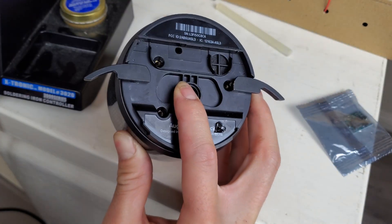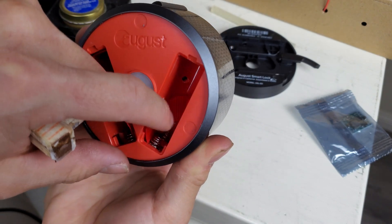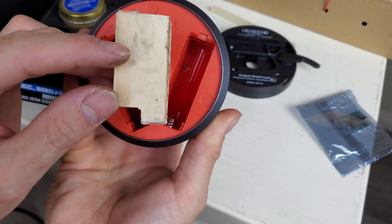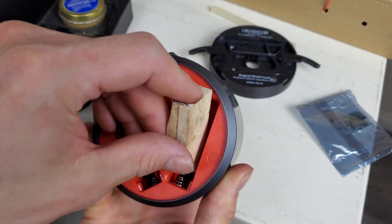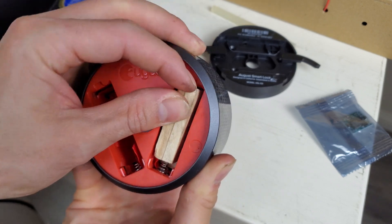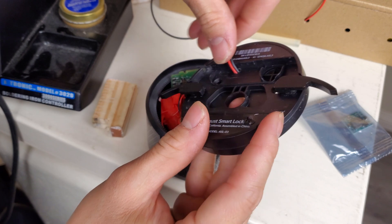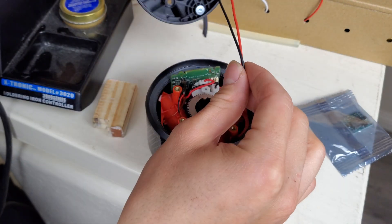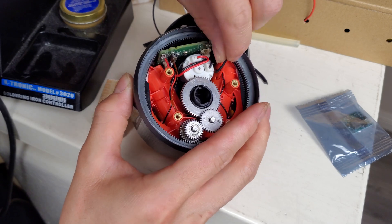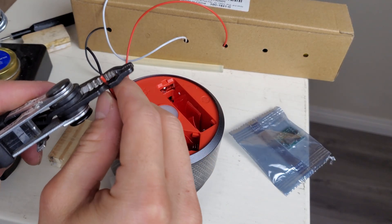Here is the slot where the wire will come out — it just clears the bracket. The connections are: outside for positive and inside for negative. So what I have here is an L-shape that's going to hook into the inside negative, and then the copper is going to touch the outside positive, just like this. Because I'm using the second generation, there are two batteries per slot, so I have to take note of the inner and outer contacts. In the third generation there's only one battery per slot, so this is not a concern.